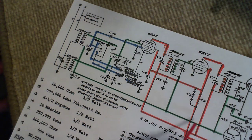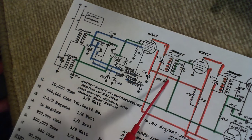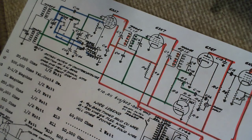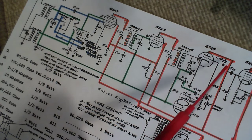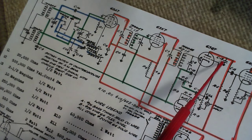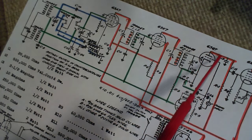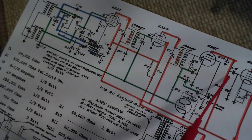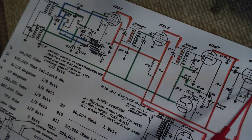So if you look now on the high voltage line again, just look for any capacitor to ground. So we see that one, we see this one. In the filter, but here's one up here, capacitor to ground. These are usually capacitors that are trying to get rid of something, get rid of RF. Shouldn't be there anymore. This is the audio part of the radio. There shouldn't be any RF, but maybe it's made it through here somehow. This is to knock down any RF. Why waste the power of this output by feeding it some RF, that kind of stuff.